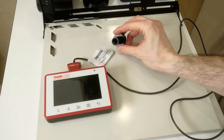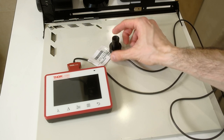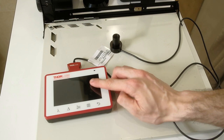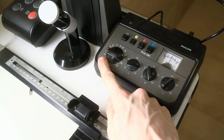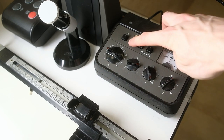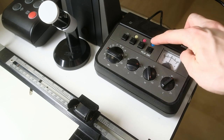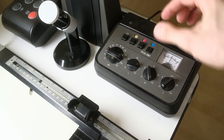It's still a surprise to me because this retro old-school electronics from Philips is actually a crazy precise measurement instrument. In comparison, my sensor doesn't have a condensing lens but the Philips calibrator does. The power landing on this sensor is in the range of microwatts. In reality this sensor is exactly the same as what you have inside the Philips calibrator, but the Philips also has three different wheels with color filters that only pass light corresponding to the proper channel.